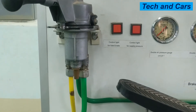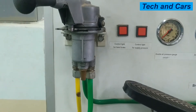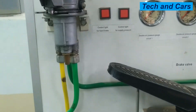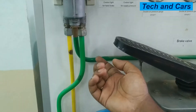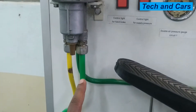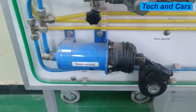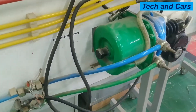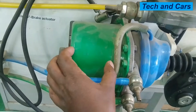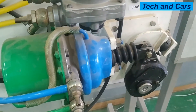As mentioned in the video discussing the combination chamber, the parking brake will be applied by the spring and disengaged by compressed air. When you want to disengage the parking brake, all you have to do is apply pressurized air from the tank. It will be admitted into the parking brake valve and supplied to the combination chamber, coming to the rear combination chamber. That compressed air will compress the tough spring, and the slack adjuster and push rod will be pulled back, disengaging the brake.